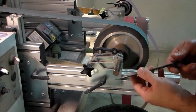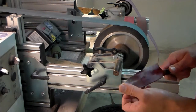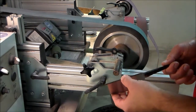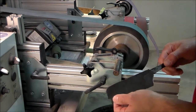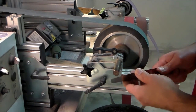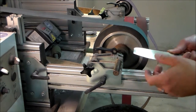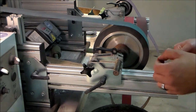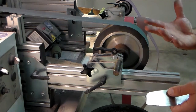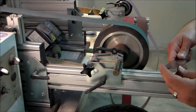You'll also notice I do this with my bare hands. Rule of thumb is that after heat treatment, I work with bare hands. As long as I can hold the knife in my hand, it's still cool enough that I don't overheat it and ruin the temper. As long as you can somewhat hold it, even if your fingers start to blister, the steel is okay. As long as you don't see it changing color, a couple of blisters won't hurt. Eventually, if you do this long enough, you get more or less heat resistant fingers. With a reason, of course.